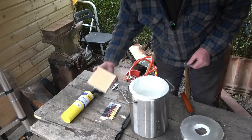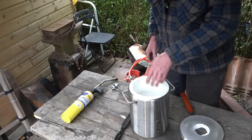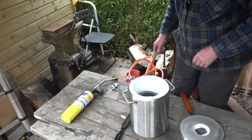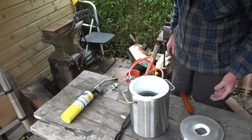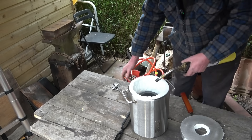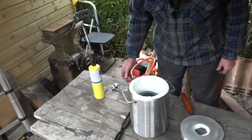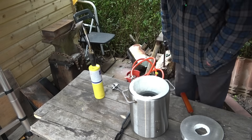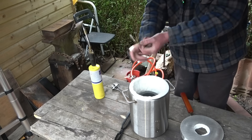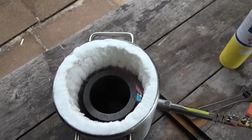I've got it hooked up to a propane bottle. The fire brick goes in the bottom, and then a little bit of cardboard between the fire brick and the crucible - that turns to carbon when it burns and stops the crucible sticking. So basically if we turn the cylinder on, there's propane coming out, ensure light - which it has done, an instant light. On a very light flame just to get some heat into that crucible, I don't want to get it red hot already. It's a nice quiet torch turned right down.